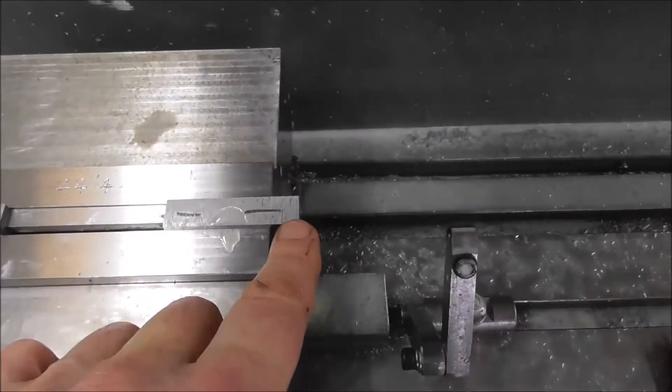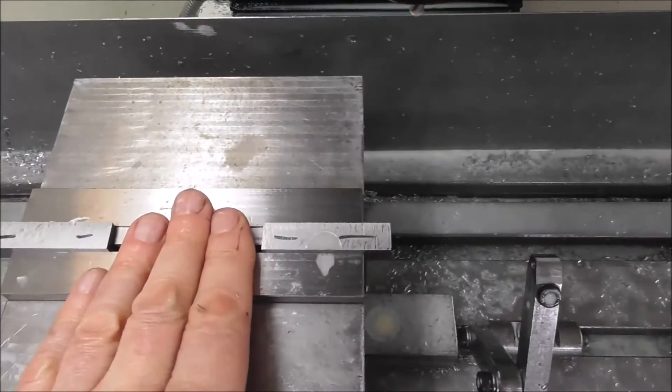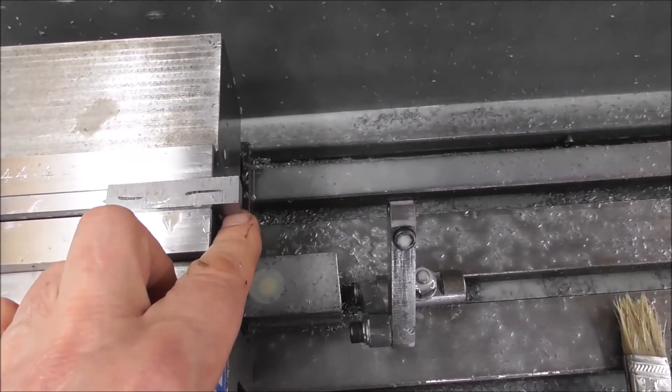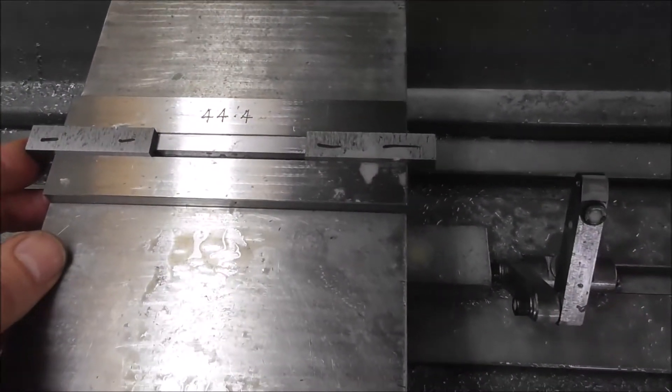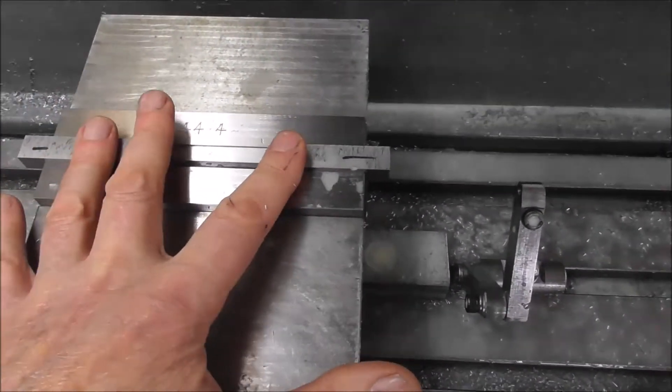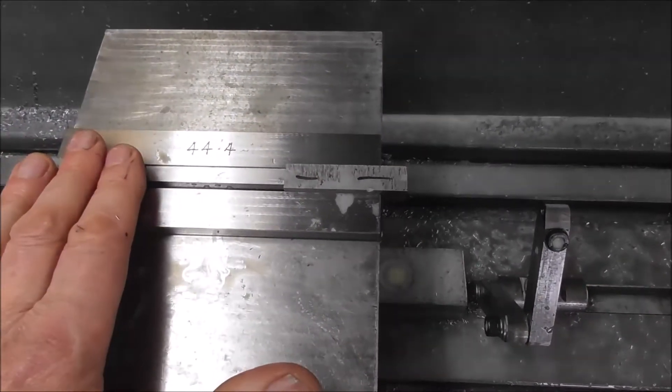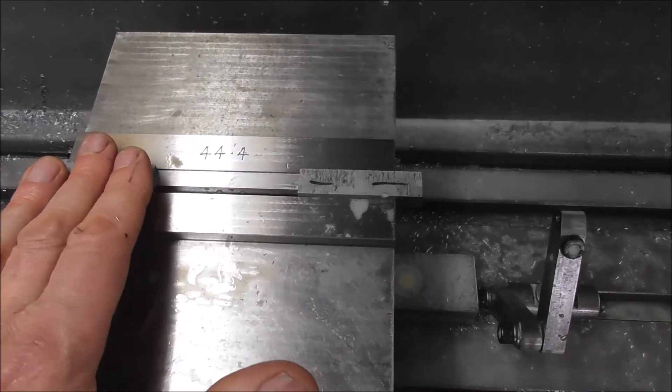For precision work it's better to have a small part on each side. If you need to have it on one side, have it in the middle of the vice. I've got one on each side because I need to drop the tool down and machine corners on the ends - I need it hanging out of the vice - so it's important to have that balance. I'll put the camera on the stand now and show you a couple of finer point tips and tricks.